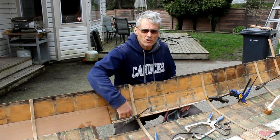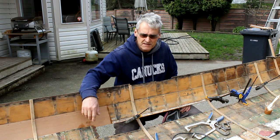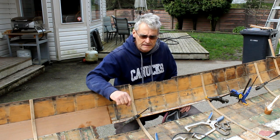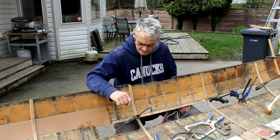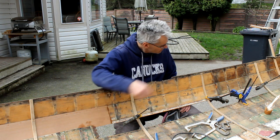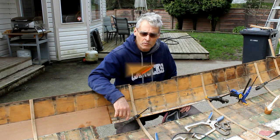Next up on the St. Lawrence River Skiff, we're going to try and replace this plank. It's about seven feet long. I've got the old one out, used pretty much as a template. And we're going to scarf in — there was already a scarf joint here — we're going to create a scarf down the other end and see if we can fit one full plank.